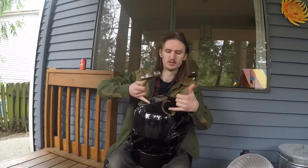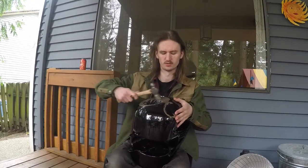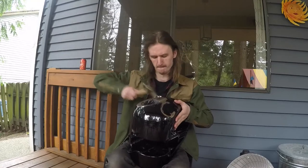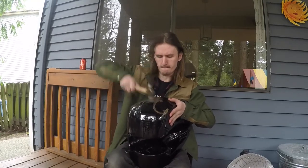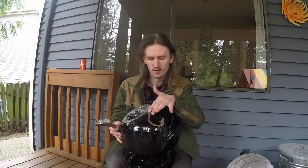What I'm gonna be trying to do is bridge this ridge here between these two dents. So I'm gonna start at the edge, just sort of working there. And you don't want to develop any folds — I've got a fold developing right here, so I'm gonna start hammering that in before it becomes a crease, because that'd be really hard to get rid of and it would mess up the whole thing.